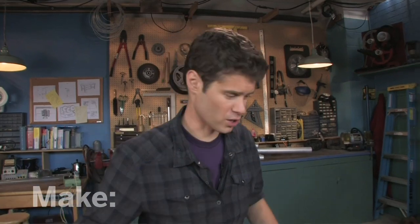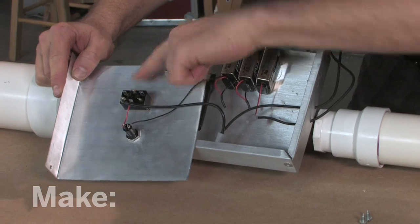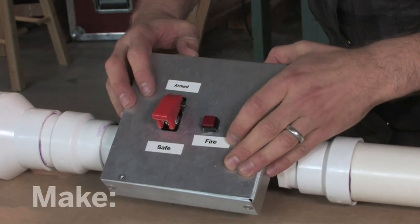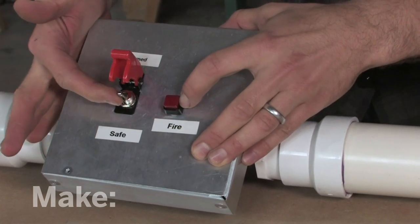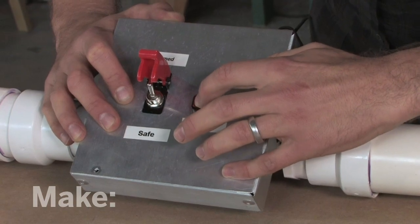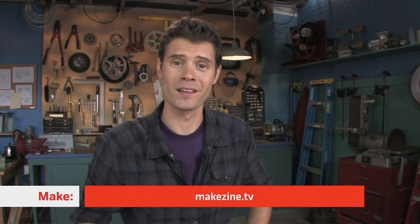Now I need a way to shoot this thing. I've built a trigger circuit using three 9-volt batteries in series, connected to a safety switch, push button, and finally to the solenoid itself. Here's my favorite part — this is a doomsday switch cover like you see in a missile control room from an old movie. When we flip this up, we can take it out of safe mode and put it into armed. When I press the fire button, you're going to hear the solenoid switch clicking. You can get all these parts at an electronics store, and the circuit is available on our website.